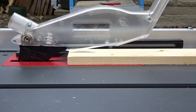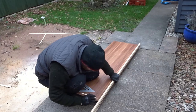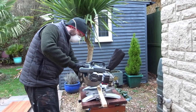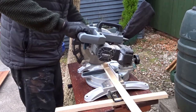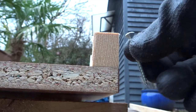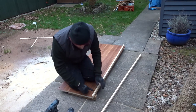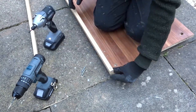Now I'm ripping down the framework on the table saw — I've gone for 2.6cm by 2.6cm for the frame sizes, and I think that will give it plenty of strength. I'm offering up one piece and making a mark, and I'm going to add the framework directly to the top. I find it just works easier this way — I can make sure that everything's nice and square and lined up rather than adding the top later on. I need two end pieces and two support pieces. Once I've cut one I can use that as a template to cut the rest. To attach them I'm going to use screws that go almost all the way through but not quite, and that should give me maximum strength on the fixing. Making sure to pre-drill holes because this is chipboard so I don't want anything to tear through.